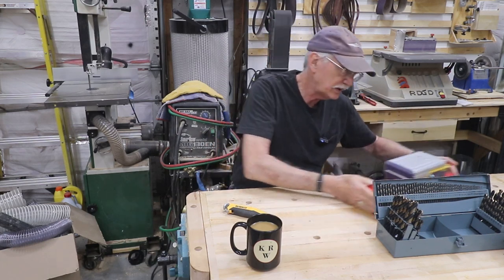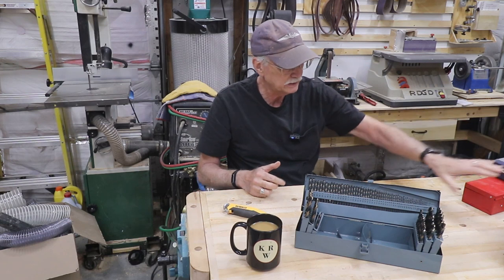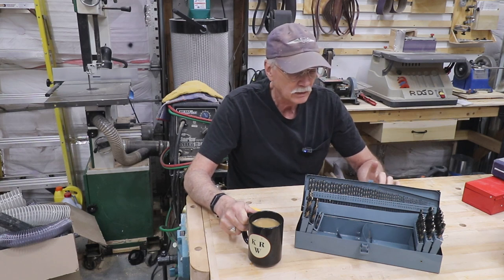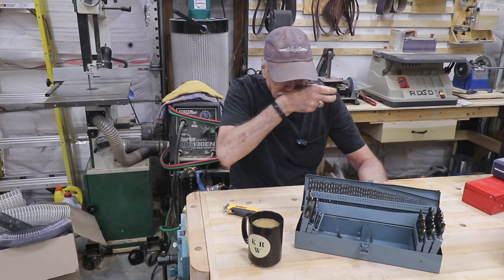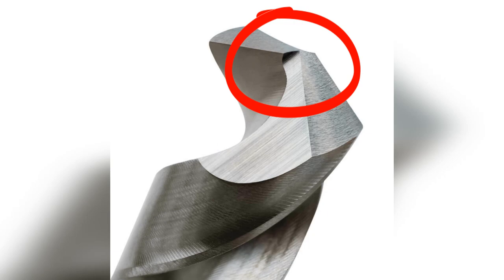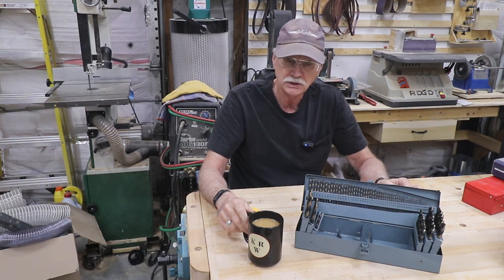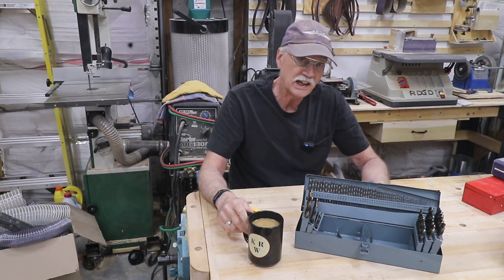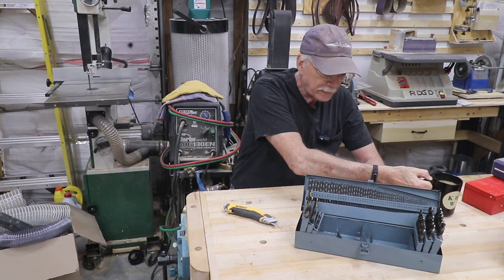This one drill index here will replace every drill bit I have. Now I have a complete index of drill bits, and they're split point — 135-degree split point drill bits. With the beauty of split points, you almost never need to do a center punch or a pilot hole to start the bit, because the points are split point. They will self-start and will stay where you hold them. Just make sure you've got 90 degrees on it.